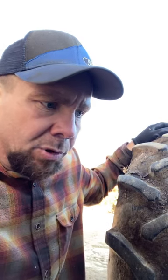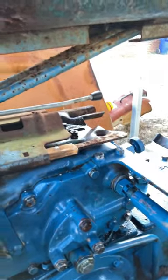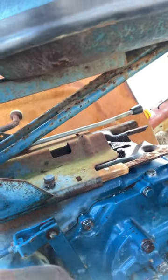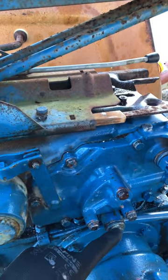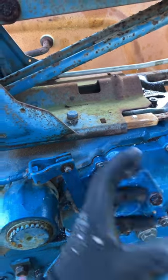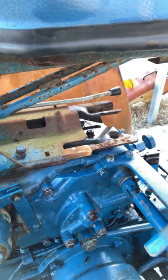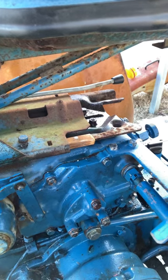The only thing left is inside the control valve. Under the top lid — but on these ones you don't have to take the top lid off because it's all disassembled from the side. You got about seven 12 or 13 millimeter bolts all the way around. Take this little clip off here, remove your high pressure line — this is a banjo bolt, don't lose the o-rings on both sides. Pull that off and this will come right out really easy. I'm going to take that apart and show you how to clean out the control valve, because I bet it has some debris.